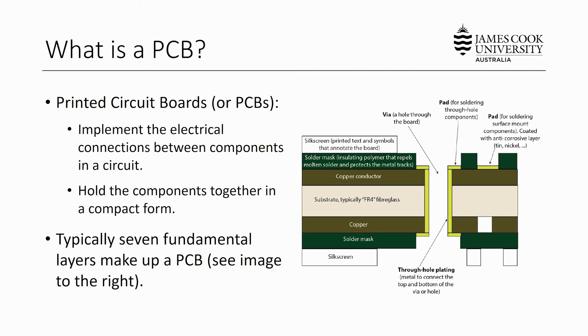There are also some fundamental components that make up a PCB. The first of which is a via — simply a hole through the board, sometimes used to mount the PCB with screws. There are also two types of pads for placing components on the PCB. The first type is for through-hole components, which have long metal legs that are placed through a pad and soldered on one end. Surface mount components don't have legs and simply rest on the top or bottom copper layers of the PCB. The final element to consider is through-hole plating — when you have a via or a hole through a board, there is an option to connect the top layer copper to the bottom layer copper via through-hole plating, which is simply a small layer of copper that fills the inner hole through the via.